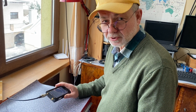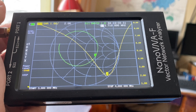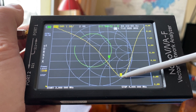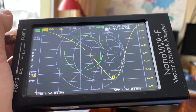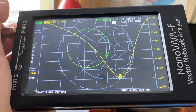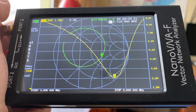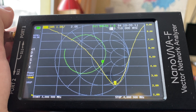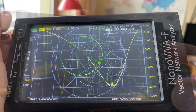Before connecting this antenna to my transceiver, I decided to make some measurements. The 80 meter band is the band of interest for today, so I made the range on the nanoVNA from 3 MHz to 4 MHz. We see a nice dip at around 3.710 MHz showing SWR at 2.05. This is pretty workable — even without the tuner — my Elecraft K3 would cope with it no problem. Of course, using a tuner would help tune it to 1:1. All in all, having in mind this weird zigzag configuration and the loaded coil, it's a pretty nice resonance, a nice dip, and pretty acceptable SWR.